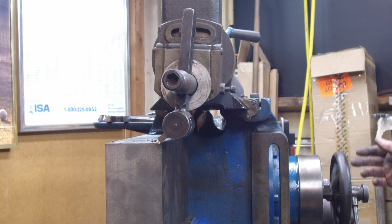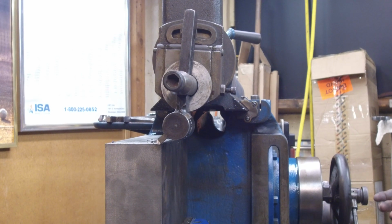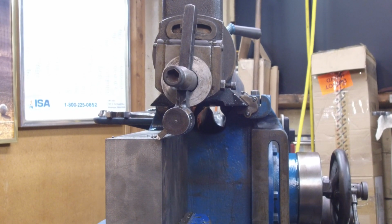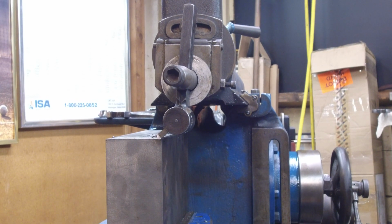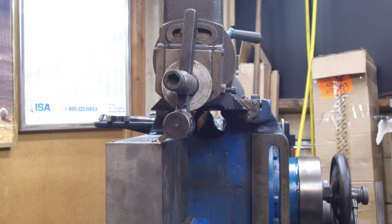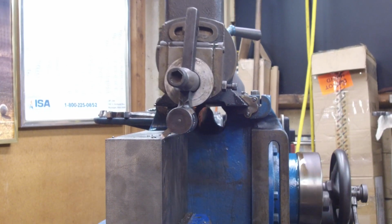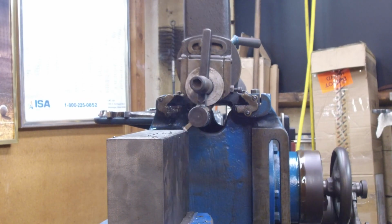All right, I found a place where I think at one time there was a spring plunger that went over a part there. I put it back on the shaper, it was there, and somehow I think there was a receiver and there was a spring in there at some time, or an adjustment, a threaded rod or something. But I took a measurement and it was basically 6 inches in there, and then I pushed it, preloaded the motor, and I created close to 6.5. The part that I found in the rem box was 6.5 inches long, so I got it in there. It's got a pretty good load on it now, and my belt is tight. All right, let's see what we got now. Oh yeah.